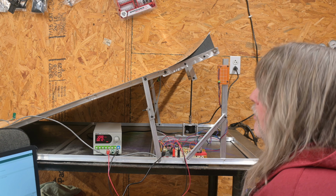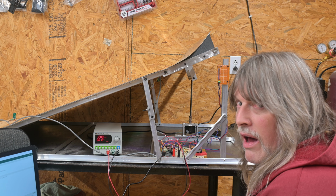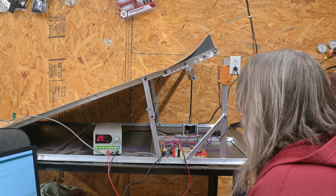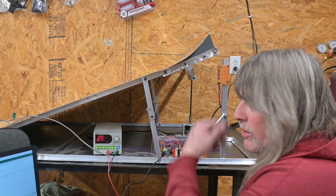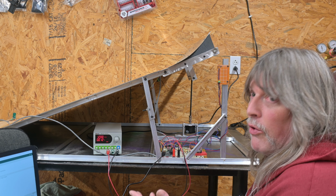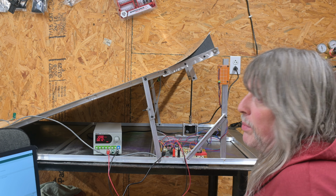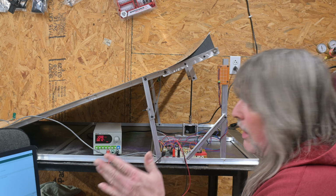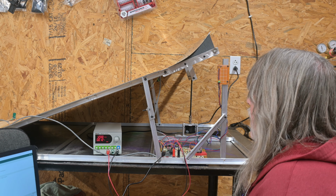So as you can see, it's in a rather crude prototype stage here. I have to package up things better, solder up some boards, and initially for my test, since I don't have any 4S's here, I'm just going to put a 12-volt garden tractor battery in there. That will have low voltage detection in there for the LiPo, and with an RGB LED, it actually will be red, green, yellow for voltage level, and it'll have an automatic shut-off on it.